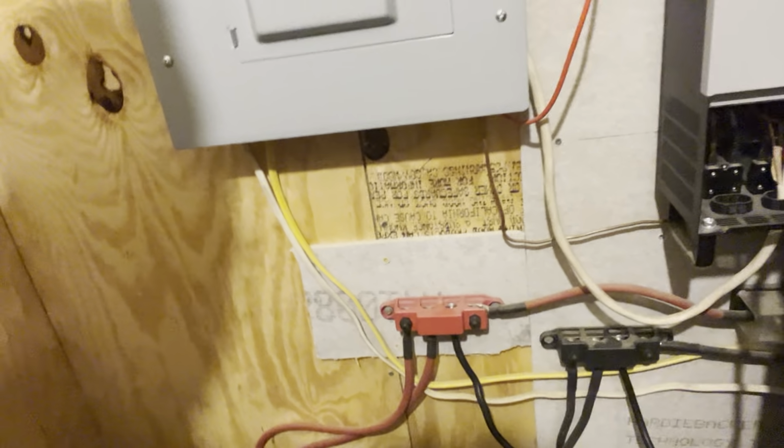So lesson learned, I had to take the thing home, charge it, which you have to use a 48 volt charger. And I guess that's the other thing I didn't say. These batteries are lithium iron phosphate. So it's the safest lithium ion chemistry that you can get. In theory, these things don't go through thermal runaway, which means that if you're gonna put it in a structure or on a boat or in an RV, this is the kind of battery that you actually wanna use.